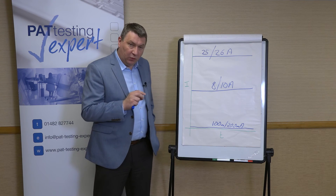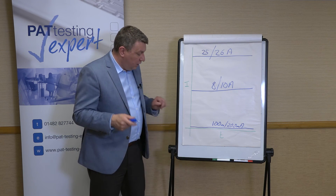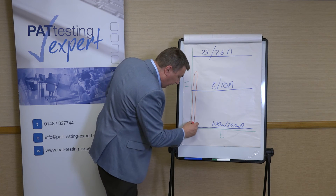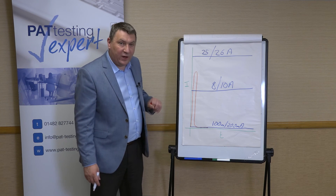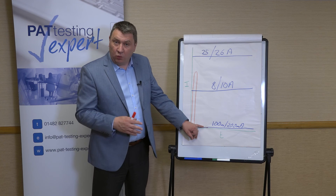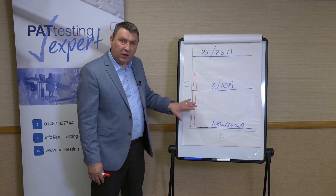Something that has cropped up quite recently: those clever folks at Seaward have come up with something they call their ZAP test. This is still a low current test, but when you press the class 1 button, it gives a little zap at the beginning of the test. I'm not entirely sure how short this zap is or quite how high it goes, but it puts a pulse through the earthing circuit which breaks down that contact resistance. It's still a low current test and it won't damage anything, but it does tend to give you a lot more reliable and accurate readings when you carry out the earth test.